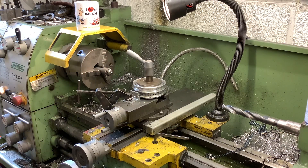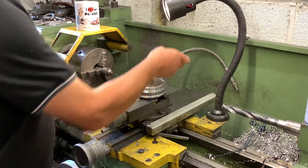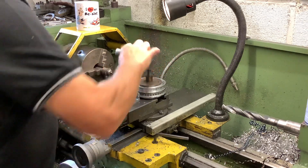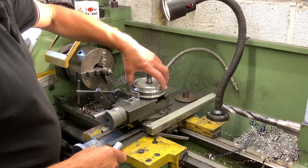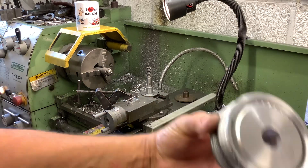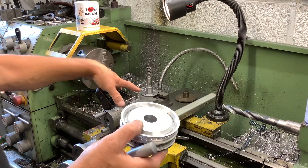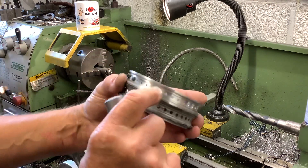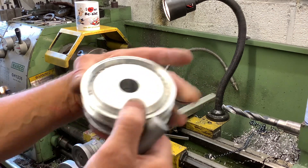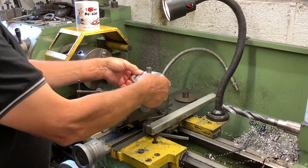So I've had to go it alone and made my own fixture. I had to make up an ally fixture with a reamed hole through here, and make shims to get the right height so I've got these holes in the middle around the rim. I've just got one screw holding the plastic one there. This is what takes the time - making all these bits and pieces to fit right.